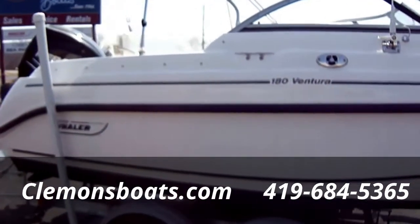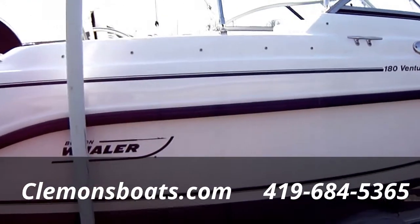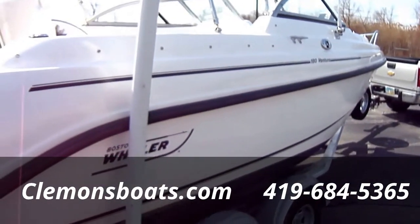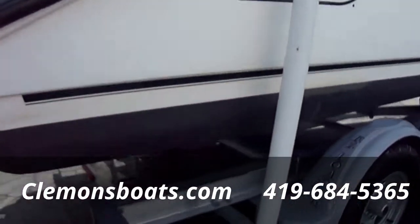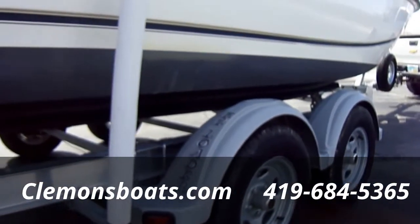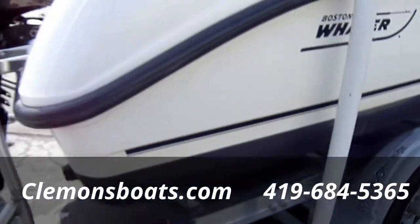It's a little hard to see on this trailer, but it is a very tall boat for an 18-footer. This boat can handle some big water and you can still feel safe. Big heavy duty rub rail. It does have barrier coated bottom paint — six coats of barrier coat and bottom paint, so it's got full protection.